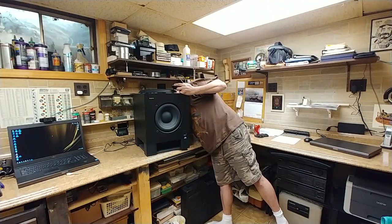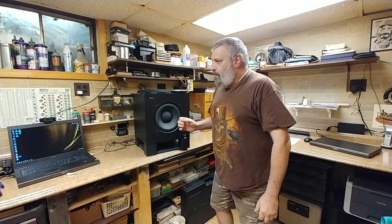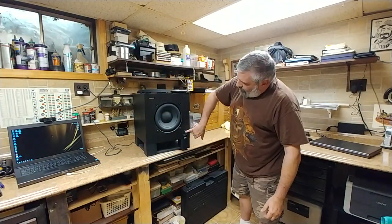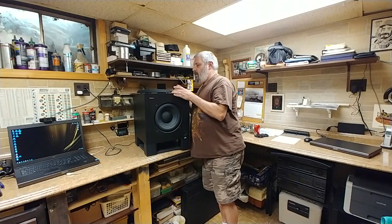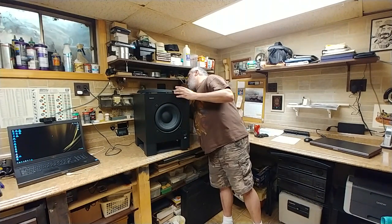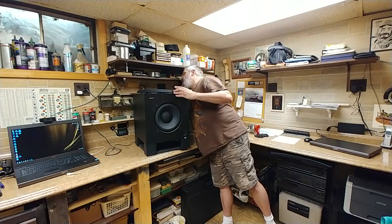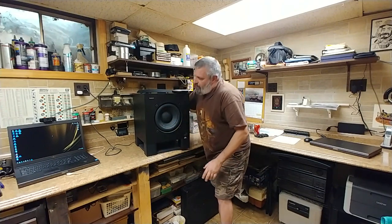I can already feel there might be a broken solder joint on the back of this thing because the RCA on the back is a little bit loose. I'll plug this in now, turn the power on — the little LED comes on. I power up the Discman and slowly turn the volume up. We've got volume, gain is up, frequency is there, phases are normal, power is on auto, boost on, boost off — and again, no sound. I don't even hear any amplifier noise. So let's crack it open.